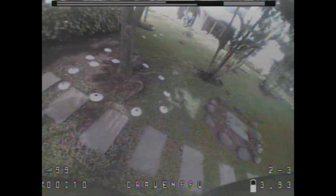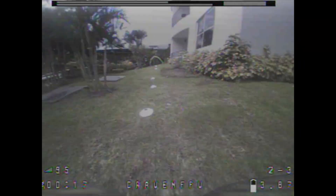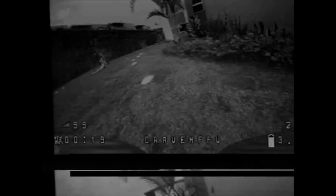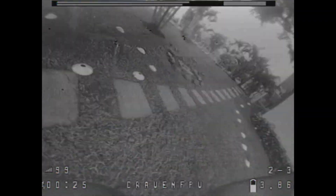After some research I found the fix, and I wanted to share it in case you have this problem. The issue with Fatshark in combination with RapidFire is that when the signal gets low, the DVR records the black flashes even if you don't see anything wrong in your goggles. The fix is to install new firmware for your Fatsharks — not the module.